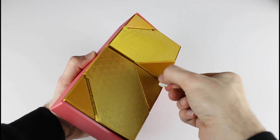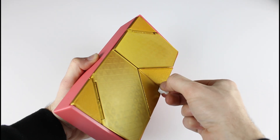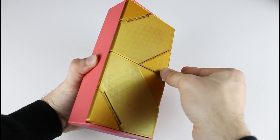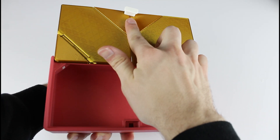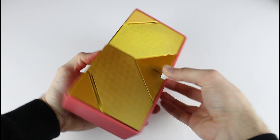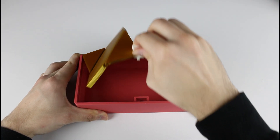Moving on to the best part of this design, the origami lid. The whole lid assembly involves four axles and four revolute joints that are limited to 90 degrees of rotation. Similar to a normal hinged lid, I'm moving my hand in an arc to open it, but unlike a normal lid, this one appears to split apart and reform during that process, giving a cool appearance of origami. As I move the knob in an arc, the two halves of the lid both rotate around their axles on the box and around the axles on the knob. Since the axles on the box are fixed and the knob is constrained to the centerline of the lid, the hinges are necessary to allow each half of the lid to compress itself so the knob maintains a constant horizontal distance from the axles on the box. You put all that together and you get a really creative take on something as simple as a lidded box.